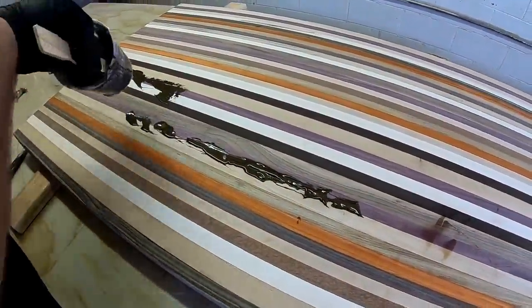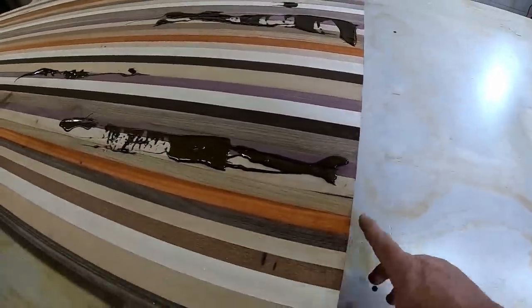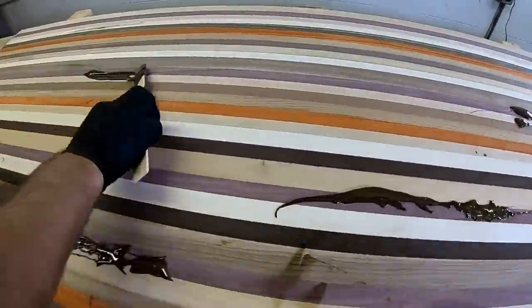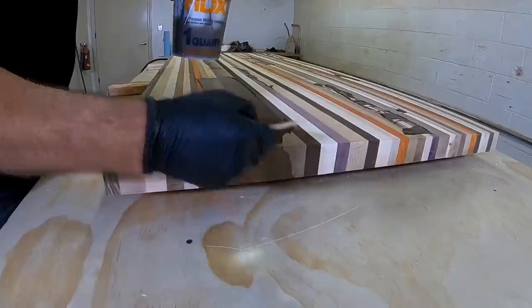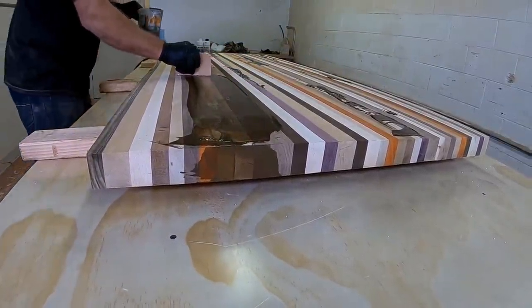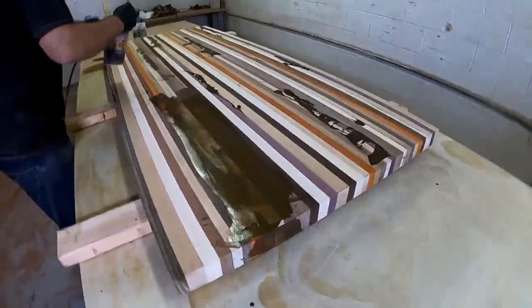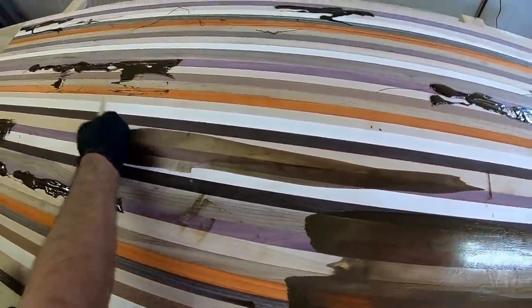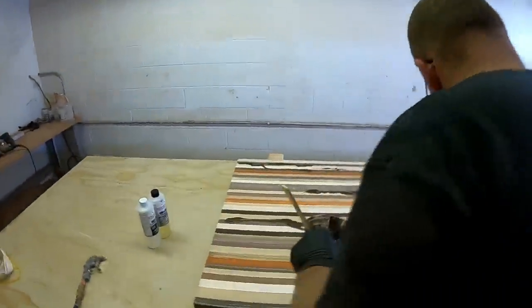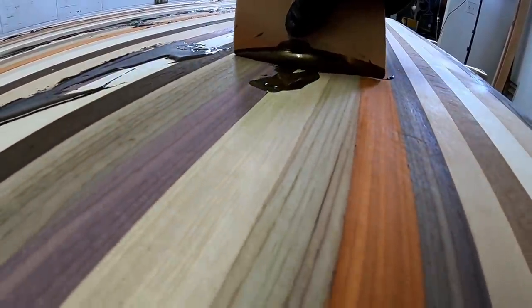We're going to overfill these cracks, and then we're going to come back after it's dried and sand everything flush. And this really sets us up for our next step when we do our seal coat, so that we don't have our seal coat dripping and going through these tiny little voids. So we've gone through our table and we've looked for any little pit or crack, and we're just overfilling any of that. Now we are making a mess on our surface, and that's okay. We're going to come back and sand off all this excess right after this dries.